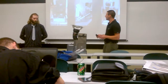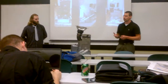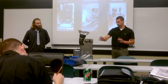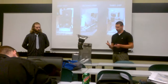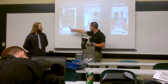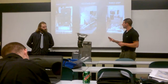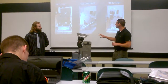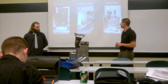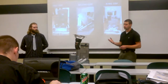All of the frame is constructed out of sheet metal that was cut and designed. I built a template using graph paper, using those dimensions to see how they would fit together and how the actuation of this part would work. We have bearing mounts here for a shaft that runs through to give support to our wheels. After we got that figured out, we went ahead and bought some actuators to angle our machine outward to get our distance. This angle is actually only about 35 degrees, but if I change the position of that actuator, I can get up to a max of 45 degrees.